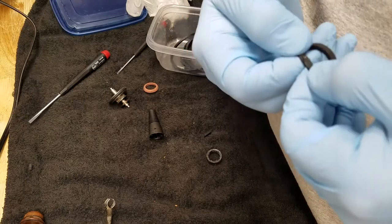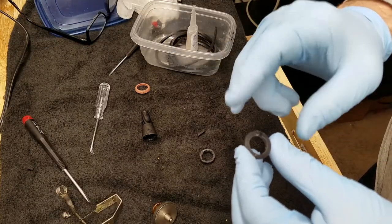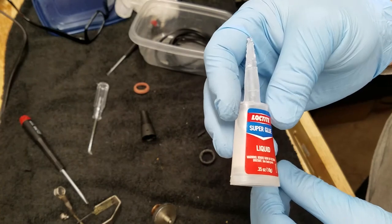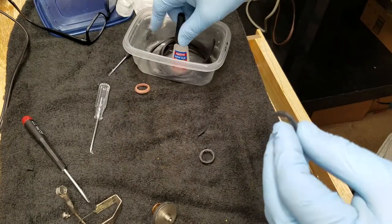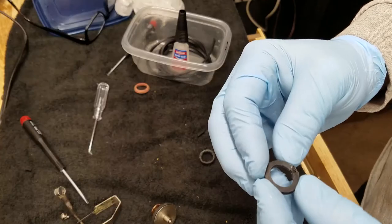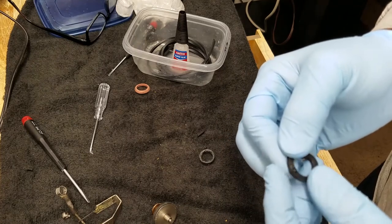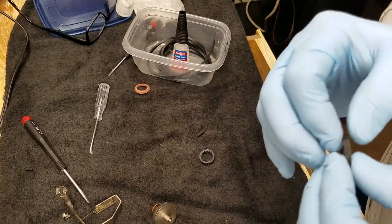I have my doubts about this one, but it seems to be holding. You can see I cut it at a bevel right there — I took a piece at roughly the right length, cut it at a bevel at an angle, then put a little drop of the superglue — this Loctite superglue. You put a little drop on each of the two surfaces you're going to glue, push them together, kind of rub it around while it's not set to get it spread. You really want a thin layer between the two pieces, then hold them as tight as you can, aligned together, for at least a minute. I wear nitrile gloves and use my fingers to help align it, because it won't stick to the nitrile very well. So I can peel the gloves off when I'm done and have a pretty good bond.